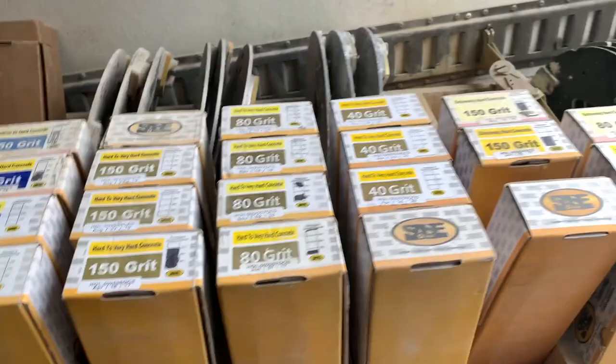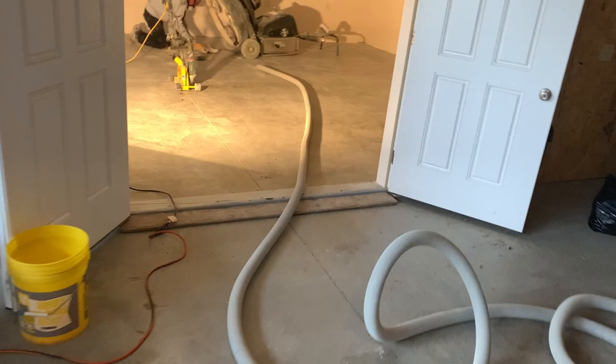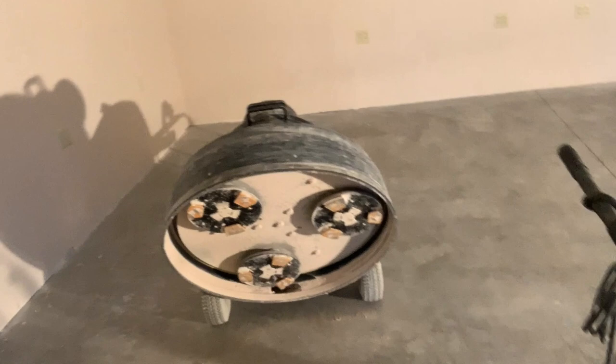And we'll get back inside here. Just about ready to start cutting these joints open, then I'll show you how we fill them. Okay, so now we're all set up. We have our joint cleanout saw. We're gonna cut these joints open, like I said. We have our diamonds mounted on the grinder, so we're ready to grind.